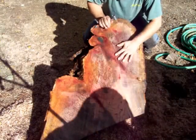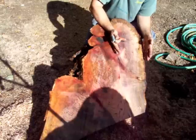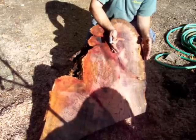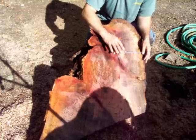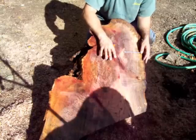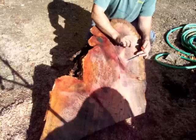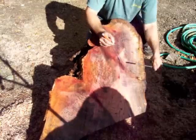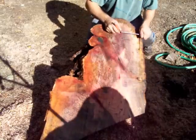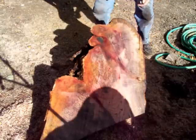It's a pretty figure right there. Alright, now this is the piece that we're going to make six-inch cubes out of. We already have six inches that thick right there. Now what we need to do is cut six inches, but I'm going to fudge a little bit because sometimes there's cracks here. This is an old burl — not a fresh burl. This has actually been cooked for about three months, and it's been sitting in the water, and that's how the gray got all through it — in big 6,000-gallon vats. So I'm going to mark it about right there, and that's going to be our cut, right down here, and then we can go to the bandsaw.